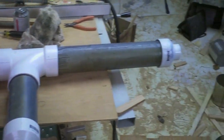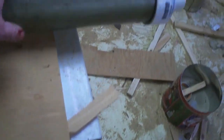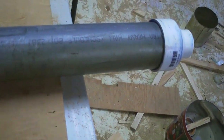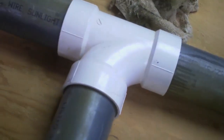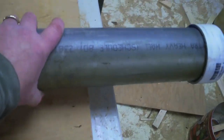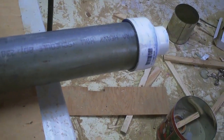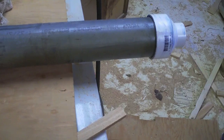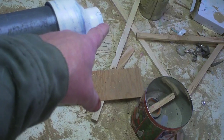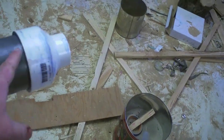I don't know exactly how big it needs to be in order to work. I know how big I would build it if I was doing mining equipment, and that's what I did. I know that if you went with four-inch mainline, you could make all these runs smaller because the water would be moving slower. But four-inch fittings cost so much more than three-inch fittings. You do not have to use Schedule 80 heavy wall pipe — I found this piece in the dumpster. The water will come in out of my pump, which has a three-quarter inch draw line and a one-inch output line, and it'll flow through this.